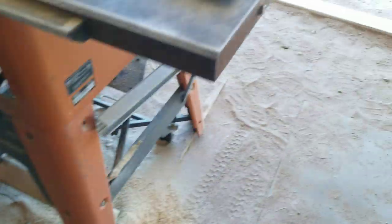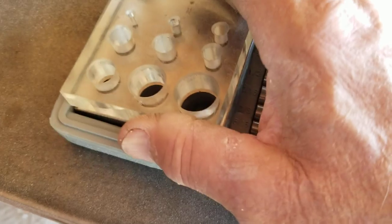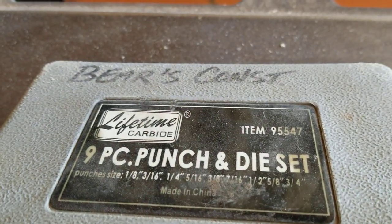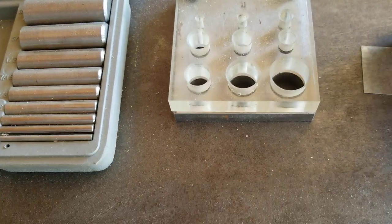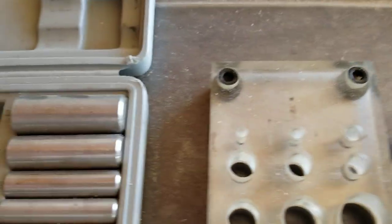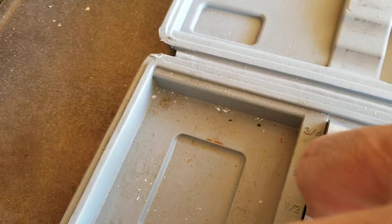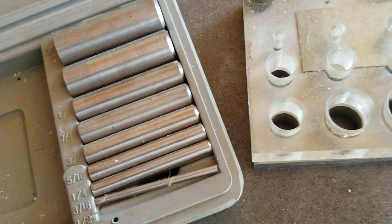What I did was use another neat little special tool — another Harbor Freight tool. It's called a Lifetime Carbide 9-Piece Punch and Die Set. So how does it work? It's pretty simple. You take your little piece of sheet metal and it slides right in through like this. Then you choose which punch you want — let's go with a 3/16ths because that's what I used on those.